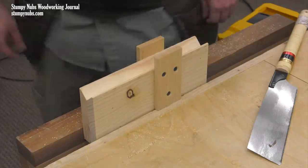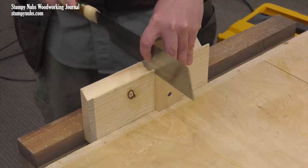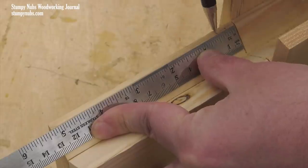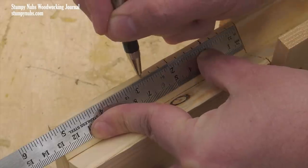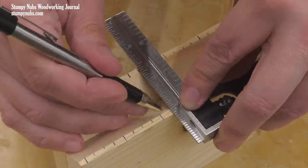The jig can now drop into my bench vise. The bottoms of the fence pieces keep it from slipping deeper into the jaws. Now I take a good fine-toothed saw and cut a kerf slightly deeper than the bottom of the V-groove. Then, starting at the kerf, I use a ruler and transfer the graduated marks on top of the little flats on the beveled edges, and I carry those marks across to the other edge with a square.